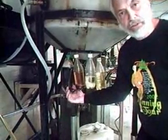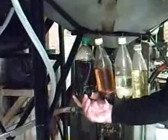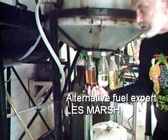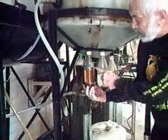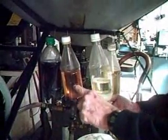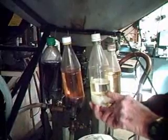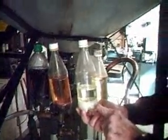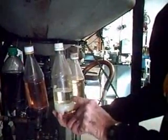This is a sample bottle showing what we start with — this is cooking oil straight from my storage. This bottle here is after I've been through the processor, heated and cooked for two hours and settling out. The esters are clear on the top and the bottom down here is pure glycerin. And after that, this right here is the next stage, which is the wash stage. You take the esters from here and run water through it, and that water cleans it, takes all the extra lye and other chemicals out, and it goes to the bottom.